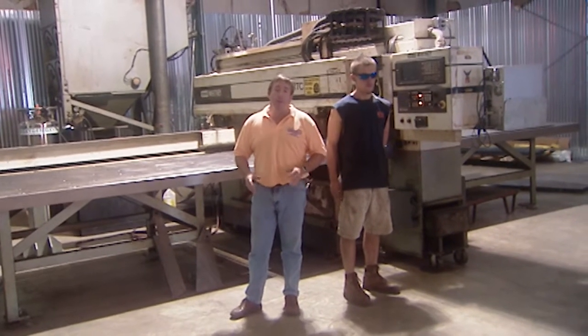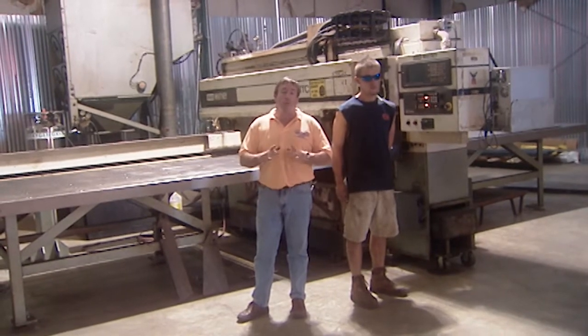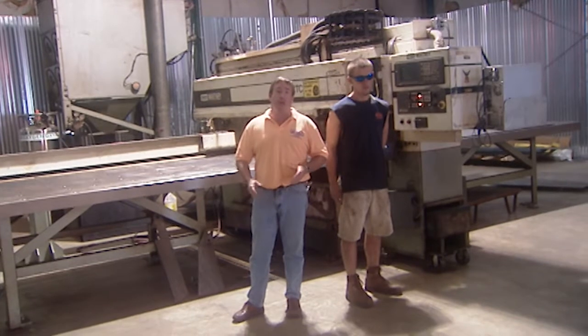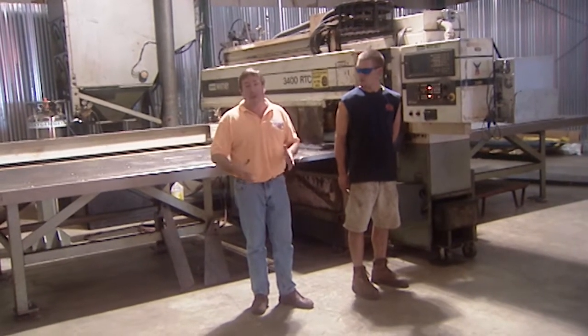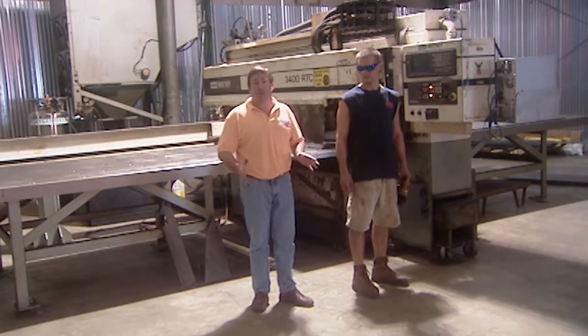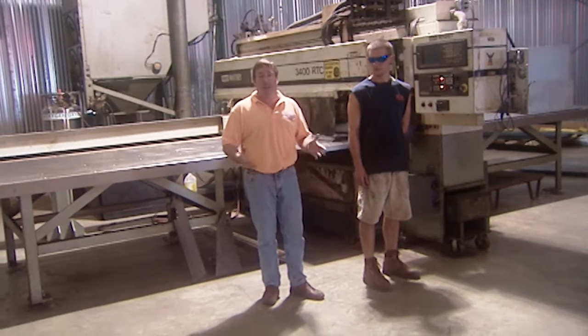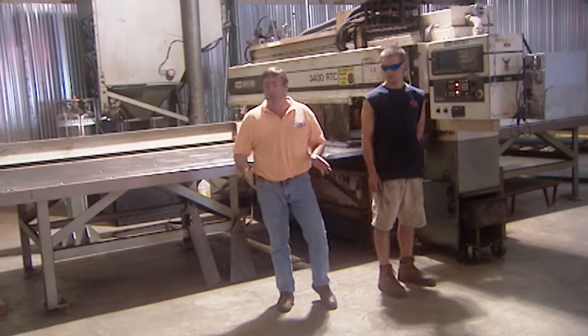It's capable of punching a 1 inch hole in 1/2 inch plate, or a 5 1/4 inch hole in 1/4 inch material. So it's really versatile. It's got a 40 ton punch in it, and it pops holes really fast. So it's actually faster than a laser at most of what it does, but just some of the things that I'm going to need in the future have to be done with a laser. So we're going to switch Miss Whitney out for a Cincinnati laser.